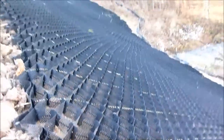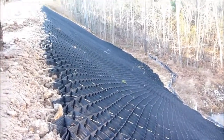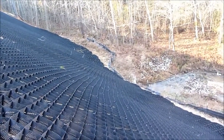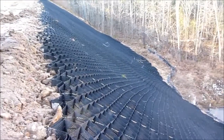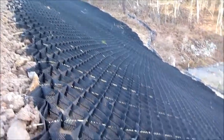It's used to anchor the slope that was failing right here. It doesn't look so steep on camera, but we'll get down at the bottom of the hill and you'll be able to see how steep it is. They replaced that 72-inch pipe down there, took all this dirt out, and didn't pack it back right, so the whole hillside was sliding down.